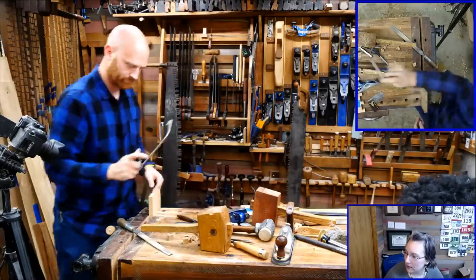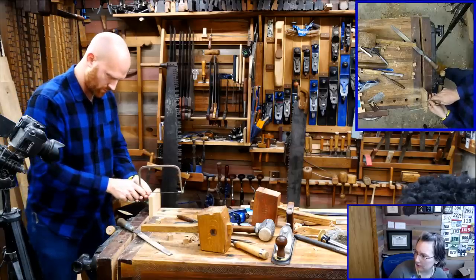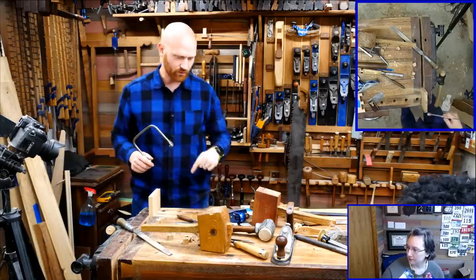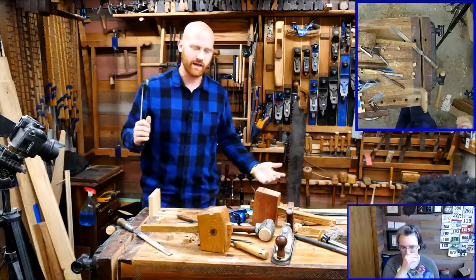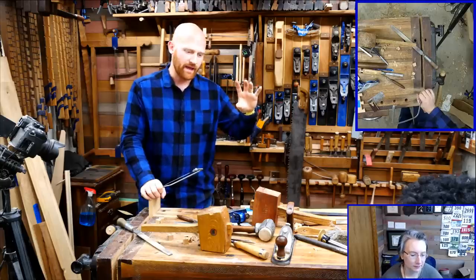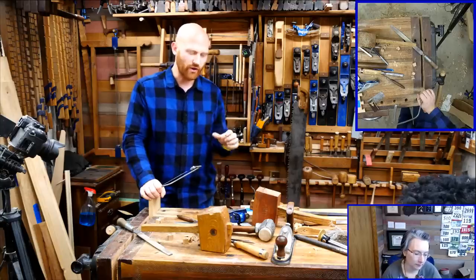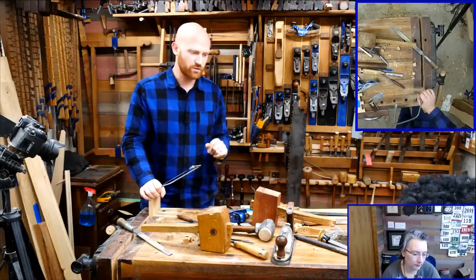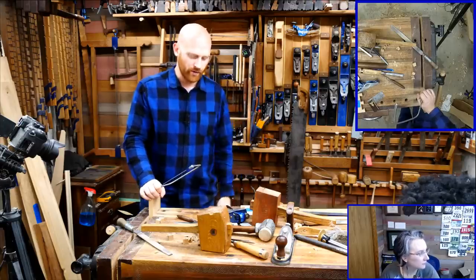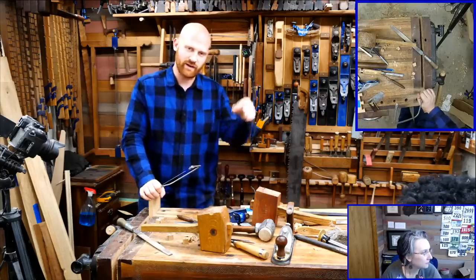James Carthew asks, why do people use holdfasts? I don't think I've ever seen one hold anything for long. I prefer G-clamps. If I use it in most any other hole, they will hold indefinitely and incredibly well. The problem is I have a 4-inch thick hard top, and holdfasts work really well with 3-inch, 2-inch, or in hardwoods, maybe 1-inch. With softwoods, 4 inches isn't as much of an issue. Or I could just open up the bottom of the hole and they hold incredibly all day long. But this particular hole, I have some wax down in there, and so the holdfast likes to slide.